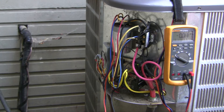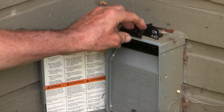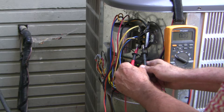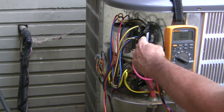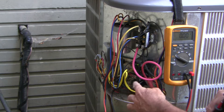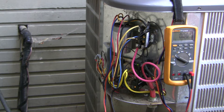The first thing I did was remove the cutout on the wall for safety. To verify there's no power coming in, I followed the incoming wires to the contactor and measured voltage — I got zero volts. From the contactor, power goes to the dual run capacitor then to the motors. The board still has some lights on — I think those are being back-fed by the thermostat battery — but there could still be 110-volt power in this system, so you still need to be very careful.